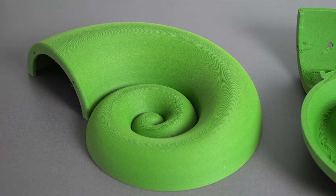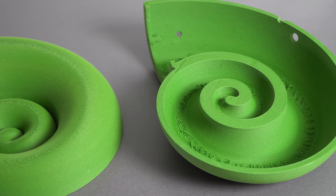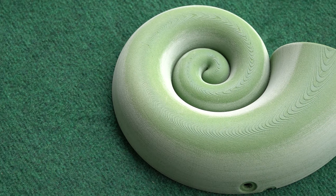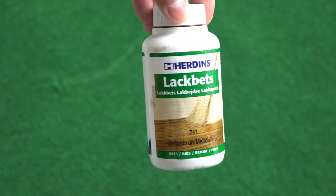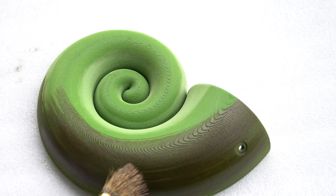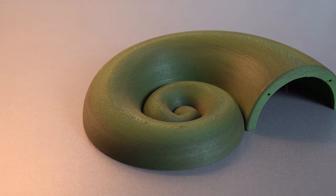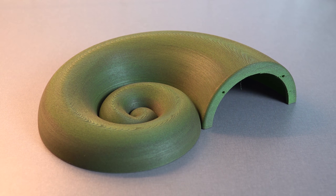The first speaker enclosure came out great and I was very happy with the results, as both sides of the enclosure came out perfectly. Now you may be satisfied with the look and color of the filament at this point, but as this is a wood filament, I used a piece of sandpaper and sanded both inner and outside of the surface to make it look more realistic. You don't need to sand a lot here, just a tiny bit to get a smooth surface that you can apply oil, lacquer, or any other wood finish of your choice. I chose to apply a wood lacquer in a medium brown color, as it will make the speaker look more like a real piece of wood. After a few coats of this wood lacquer, I left it to dry and the results were beautiful. Now it looks more like an actual piece of wood. I chose mine to stay like this, but if you wish to have an even more glossy surface, then spraying a few layers with a transparent lacquer should do the job.